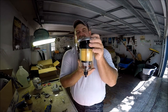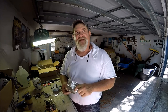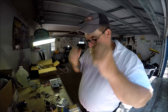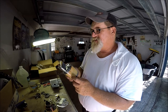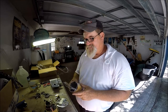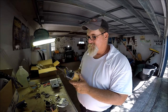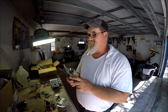And then my filter would be just like that. That's the trials and tribulations of changing this out. But this filter that you replace is just like the Raycor - the latest in fuel filtration design, used for portable marine fuel systems. That's another thing that bothered me - portable? What are we talking about, gas cans? I'm not throwing away my Raycor. It's a 10 micron filter cartridge, disposable, ethanol fuel compatible.